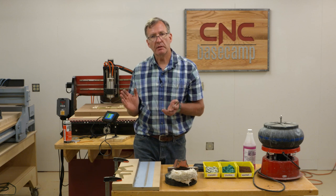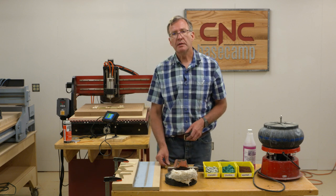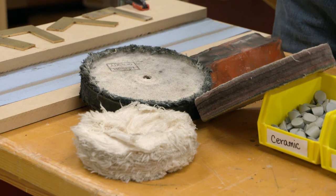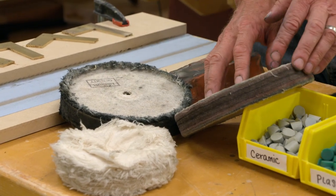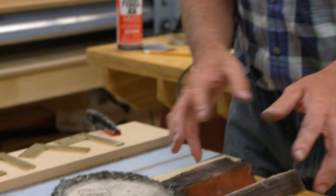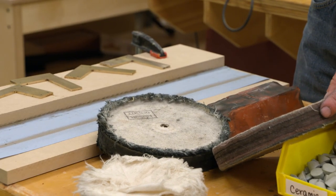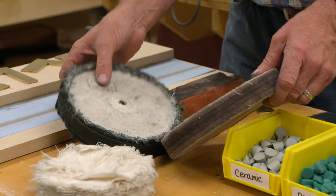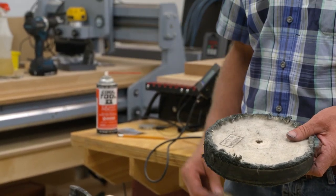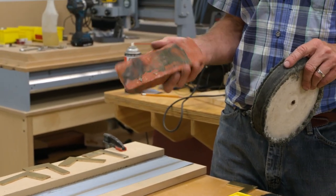So that's a nice easy, low-tech way to create a nice finish — it really doesn't take much in the way of materials or supplies. If you'd like to go for a nice polished look, then we need to talk about another method, and that is using buffing wheels. There are three kinds of buffing wheels: soft, medium density, and hard density. The soft wheels have the advantage that they'll reach into complex textures. A hard wheel can really cut into tight areas and leave a very clean line. I like to use a medium density — it's a good all-around wheel, and that's what I've been using for our blade squares. Buffing wheels, of course, require a compound. This is red tripoli, which is a good all-around compound for polishing brass.